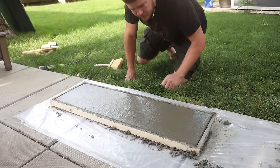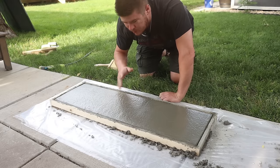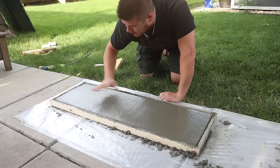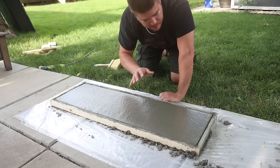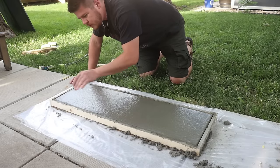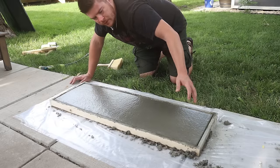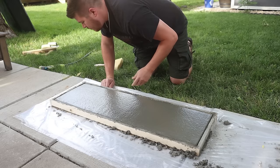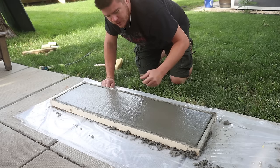About three hours since pouring and two and a half hours since edging — these are looking pretty good and firming up nicely with the water evaporated off the top. I'm fine with the finish on these since they're going in a corner, but if you want to really refine the shape, come out at about the hour-and-a-half mark, run your edging tool around it, and retrowel the top for a nice hard trowel finish. I just wanted the corners broken over so they weren't sharp — that's good enough for me.